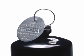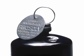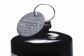The filter minimizes odor and acts as a secondary flashback arrestor during the recycling process. The 40 steel recycling certification tags provided with each filter serve as the filter replacement indicator. When all the tags have been used, the filter must be replaced.